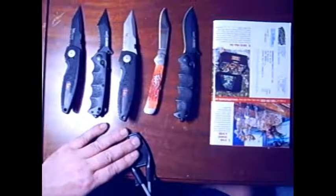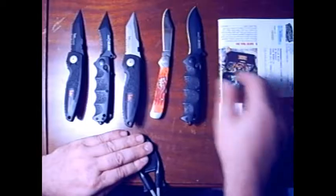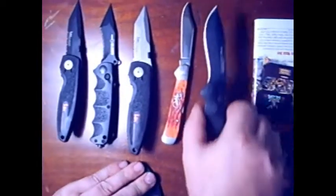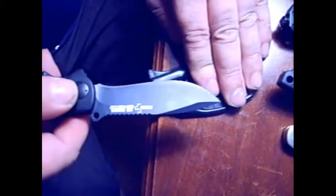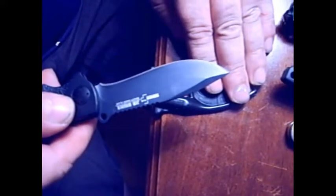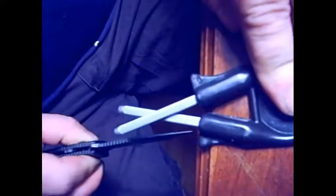Hi, this is Paul Block and I'm here to show you today how to sharpen a few different pocket knives. There are a few techniques to use with a block knife sharpener. For a smooth blade, the main thing is you want to spring it in there tight and roll it back. What this does is reline the blade — it squeezes and pushes it up, taking it back to its original cutting edge. It takes off very little steel, which will make your knife last a lot longer. You don't favor either pin — you pull it right straight down the middle.